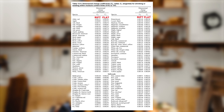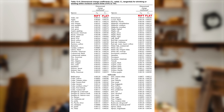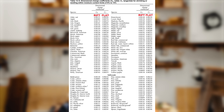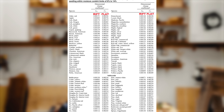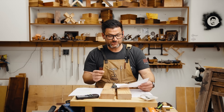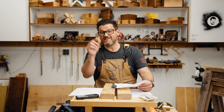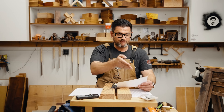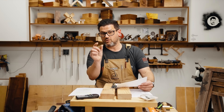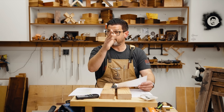When you look at the chart, hardwoods are on the top and softwoods are on the bottom, with the species on the left side. There's a CR column for the radial coefficient and the tangential coefficient — data that the Forest Service put together by testing species after species. You can see the rift or quarter sawn radial coefficient is smaller than the tangential flat or plain sawn coefficient.